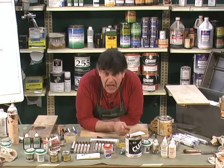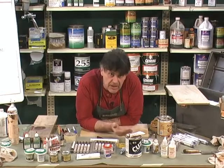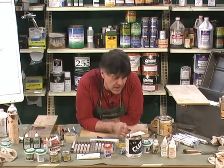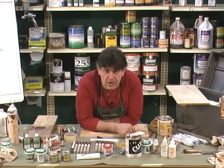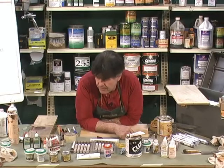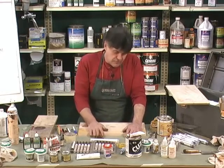If you use a solvent-based dye, and I'm talking about an alcohol-based dye, it will soften the top of even that. The only ones I've not seen that it will soften is the polyesters, which is the body filler, and the cyanoacrylate and epoxies. But those are the most difficult to color. But they also give us the most permanent repair, particularly out on edges and whatever. Filling and learning to deal with it is almost a complete art unto itself.